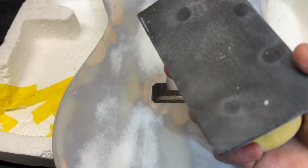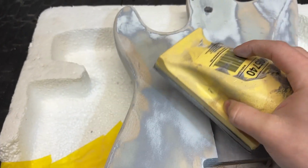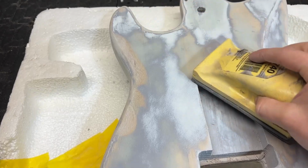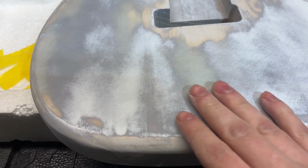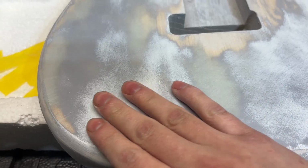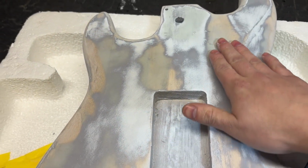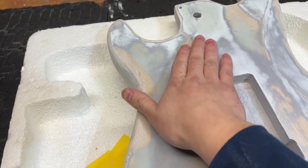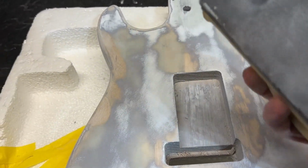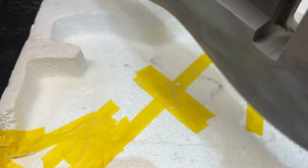or two. Used a flat block sander to just kind of go on with hand, and I used 80 grit, 180, 220, and then 320 grit to finish off. And as you can tell, a lot of the grain has been filled, and finishing off with 320 is great because it helps you feel your imperfections or anything, but so far I don't feel anything at all. But I am still going to sand it with 220 and 320 again, just to make sure I've got everything